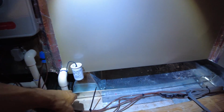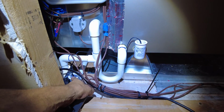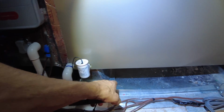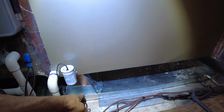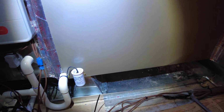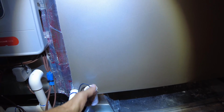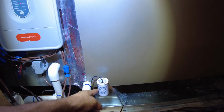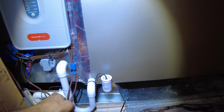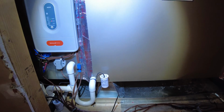secondary pan with the water switch, overflow water switch, so if any water is leaking from the coil, it's gonna go into secondary pan, and it's wired to turn off the system. We also have secondary overflow switch on a primary pan on a secondary line. Also, the drain pump is wired to turn off the system if pump is not working.